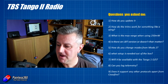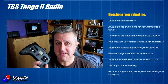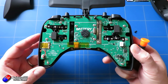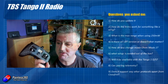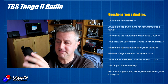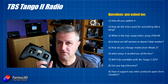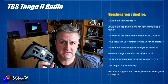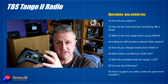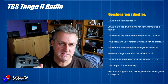The next question is about logging telemetry. Although it's FreedomTX — a fork of OpenTX — this is really OpenTX. There is an SD card inside, hidden away, that has all the files needed to run the radio. It's not accessible externally so you can't remove it, but if you're using lots of telemetry it may be worth considering upgrading that SD card. Telemetry and all other OpenTX features are available in FreedomTX, plus there have been a couple of tweaks to decrease latency between the sticks and the Crossfire system, and to make the Crossfire LUA script the first menu item.